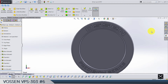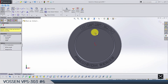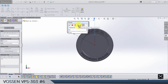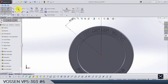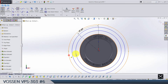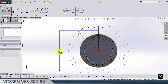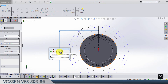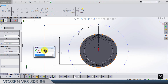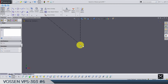On this face we need two center lines at an angle of 47.5. We need three circles — make them all for construction. The diameter of the smallest is going to be 49, the bigger one 53.25, and the biggest 55.5. Make sure the middle one is centered.